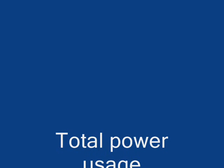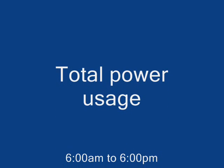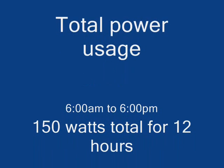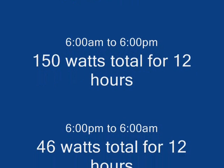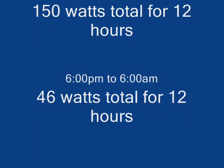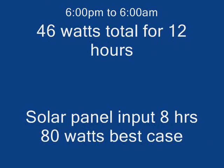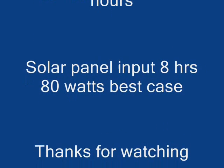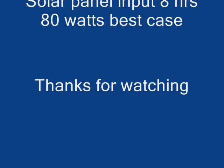Right now I'm having a little bit of a problem with my water pump for my main aquaponics system — it's pulling a lot more watts than it's supposed to. I'm pulling about 80 to 90 watts and it's supposed to be a 50-watt pump, so I'll probably be replacing it. That's why my watt-hours are up during the daytime. But everything else is working great with no problems. Please leave any comments or suggestions in the comment section, and thanks for watching.